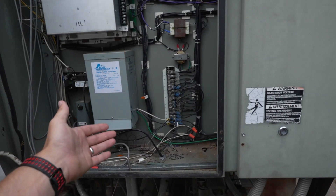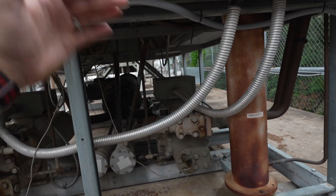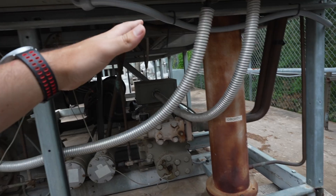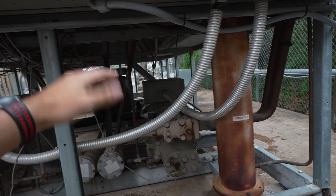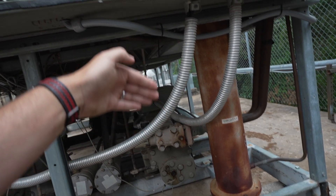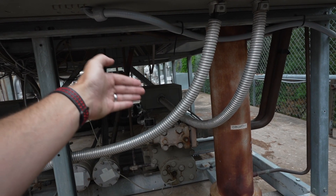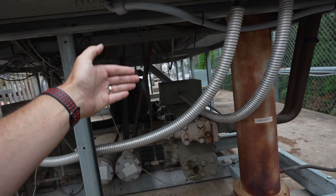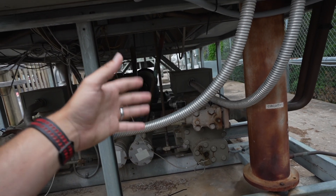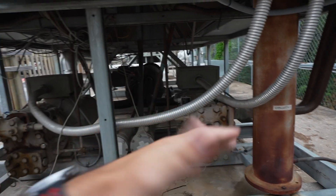Then I was able to go through a startup, and sure enough at startup it didn't activate, and I was able to maintain proper evaporator saturation during the startup phase. When it came time to start loading, it energized my female unloader, de-energized the male unloader, and energized the male loader solenoid. I started pushing my slide and the compressor began to stage accordingly. It's working fine now, and I was able to do a full startup from a pump down without issue.